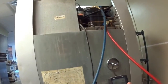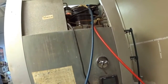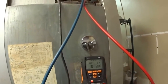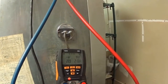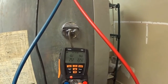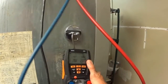There's a time delay on the digital clock. My pressures were three hundred and something pounds head pressure. We just blew the condenser out, and it's brought the head pressure down quite a bit. This is 404A — it's a freezer — and the pressures are in pretty good shape now.